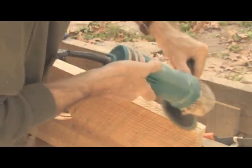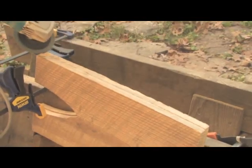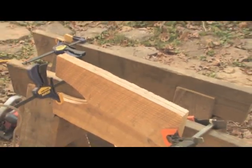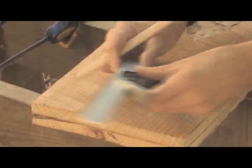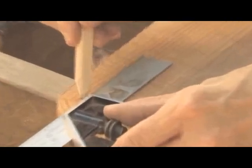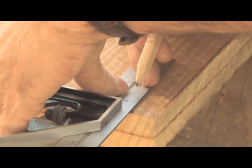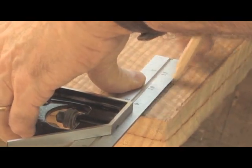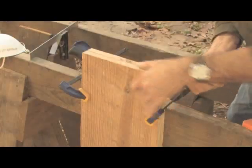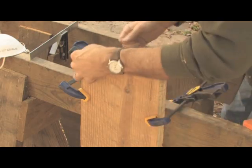You could choose to sand the edges smooth, but grinding fits with the other rough surfaces and will create a more rustic look when you apply milk paint. Mark the cut-outs for the front and back stretchers to fit. Since the edges have been tapered, align the square referenced from the top of the legs. Clamp the board securely to your sawhorse and, with the legs clamped together, both parts can be cut at the same time.